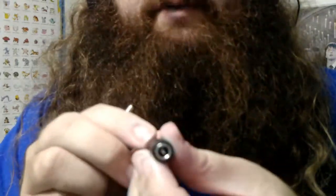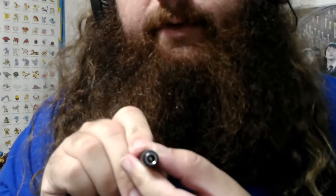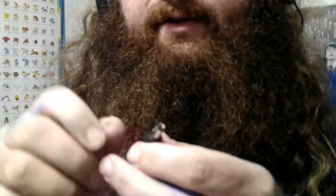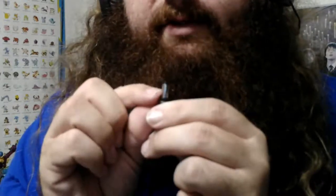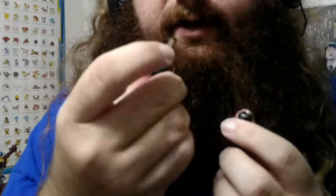A barrel jack has male and female varieties, named similarly to the barrel of a gun or a cannon. The female end has an outside that's basically a cylindrical hole, and inside the hole there's also a large, sturdy pin. The pin is usually center-positive, but it just needs to agree on both ends so you don't get it backwards. The center pin carries one conductor, and the shell around it carries the other. The male version is a thinner cylindrical shaft — the outside connects to the outside shell, and the inside goes around the pin. A thin plastic ring on the male end separates the shell from the inside, and that's how they connect.